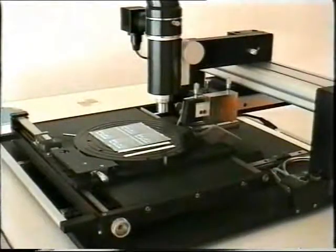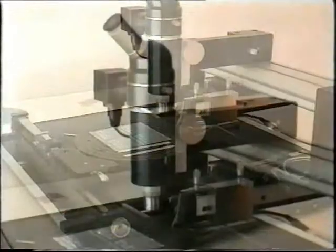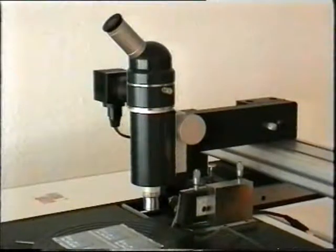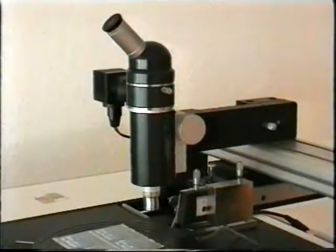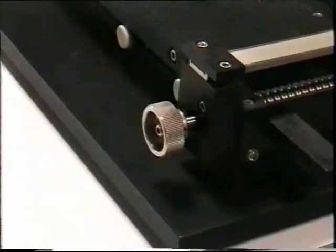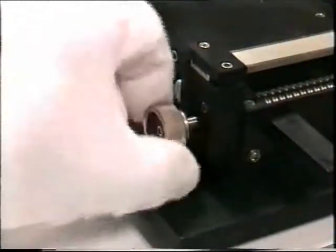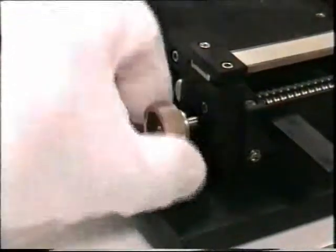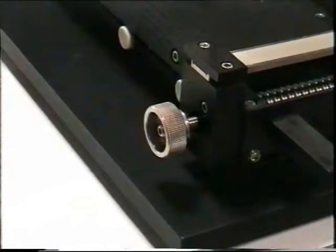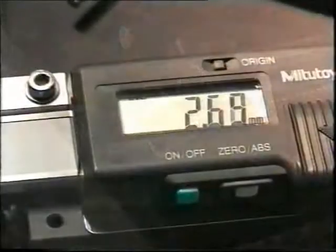The model RV129 has a 25 times microscope with XY crosshair and illumination. The Y line, or vertical line of the crosshair, is lined up with the diamond tip. By moving the table back and forth, the reference marks or traces on the wafer are aligned with the Y line of the microscope by turning the micrometer screws for the theta and X positions of the table.